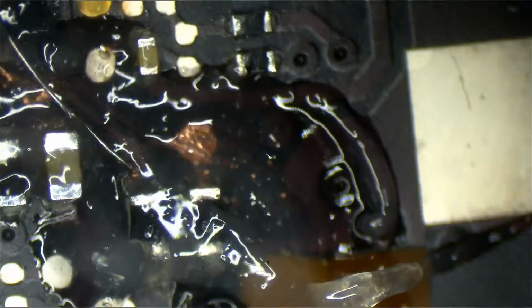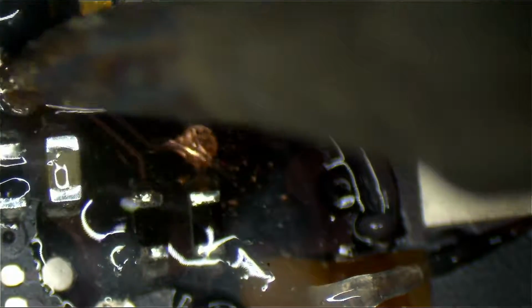So we'd say, here, have 12 volts. Now here, have none. Now here, have 12 volts for a second. Now here, don't have 12 volts. And what happens is it averages out to 1. So if you have a little bit of 12, a lot of nothing, a little bit of 12, a lot of nothing, and we keep going on that way, it'll average out into 1.